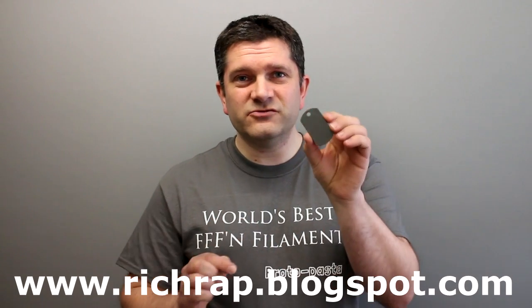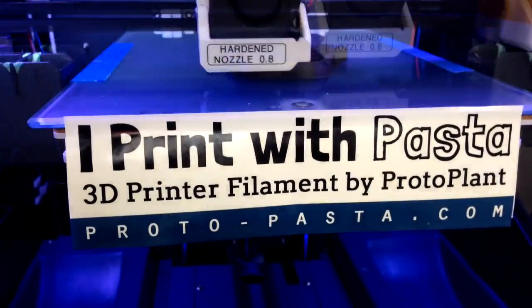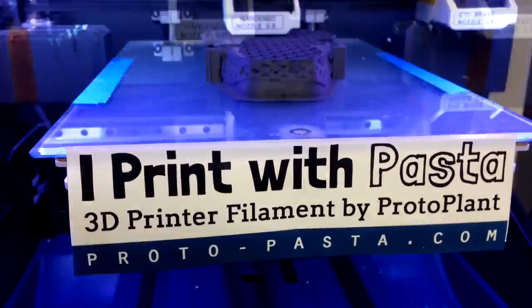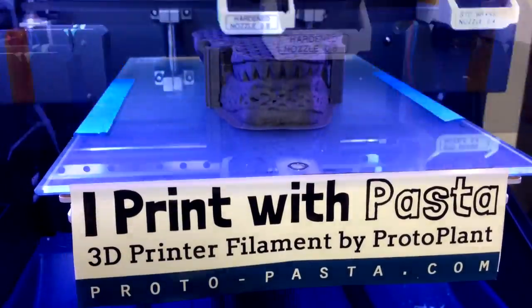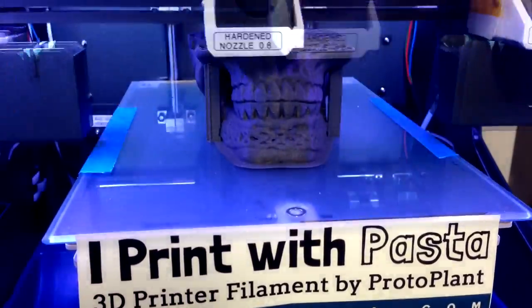The first thing you want to do when testing any new material is print some test pieces so you don't waste material on objects that go wrong. I always print a little dog tag at 100% infill. It's a quick but thorough test — you can check your flow settings for the bottom layer, infill, and top fill, and also check extruder retraction settings because it has to move to the hole in the dog tag. My very first test was fine.